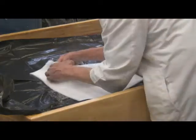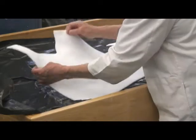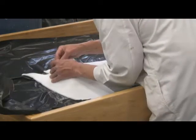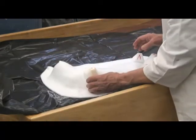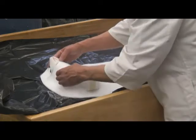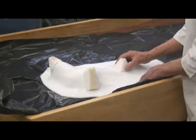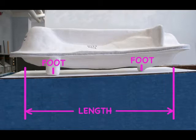Cut and fit felt padding over the fossil, and sew the dart together. Cut and shape polyethylene feet — three feet separated as far apart as possible is the most stable. On long heavy specimens, form the feet in towards the center about one fifth the length of the jacket from each end. This reduces the length of suspended weight in the center of the bone.